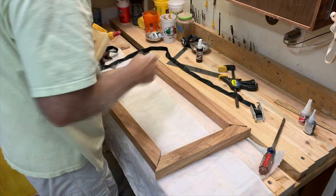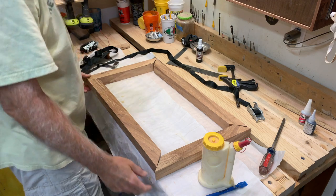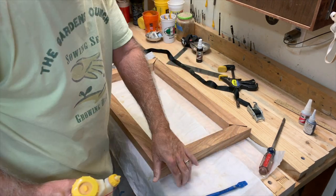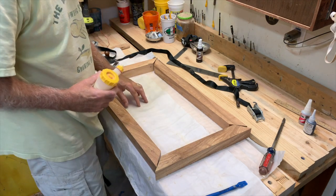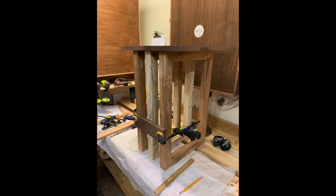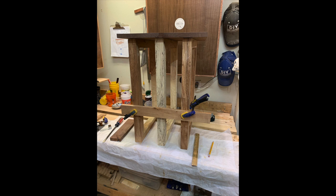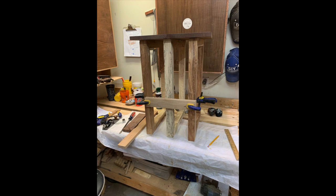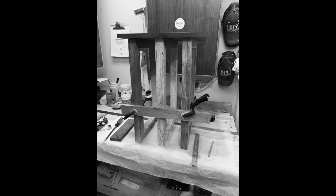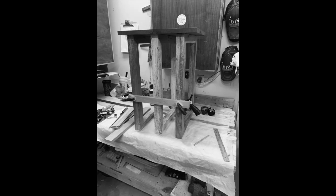I'm going to do a glue-up with a strap wrapping around it, with enough parchment paper underneath. If you've never done a glue-up with parchment paper, glue and your project will not stick to it — it peels right off. Makes it very easy. After I had all the legs cut and put together, I had to decide how wide they should be apart from each other, how wide or thin the stretcher should be, and what it should look like. I tried them at different widths, even used black and white to get a true look to see if they were too wide apart or too narrow. Anyway, we decided and on we went.